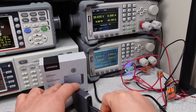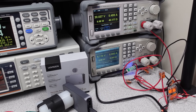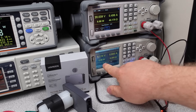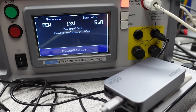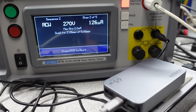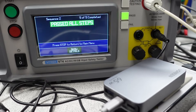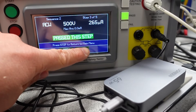So far we've got an awesome form factor, good power negotiation, and a reasonably wide range of USB voltage modes on offer — this is actually looking really good. The isolation on this device is good in terms of keeping AC mains on one side and DC voltage on the other. It offers low enough worst-case leakage current that users should not have a problem with the tingling feeling you get from some adapters.